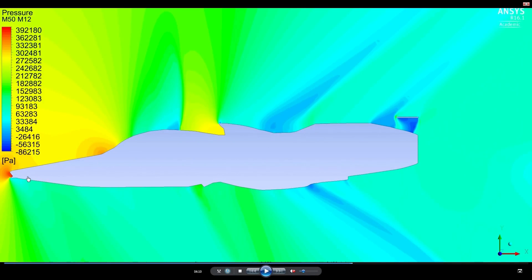There's going to be a large hinge moment wanting to flip this thing back because of the pressure buildup, though not too extreme even at supersonic speed. The negative pressure will want to collapse this horizontal stabilizer, so you'd want to reinforce the bars connecting it to the M50 so it doesn't pancake in. But overall it's looking pretty good.